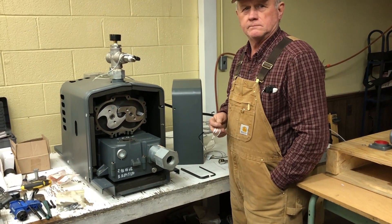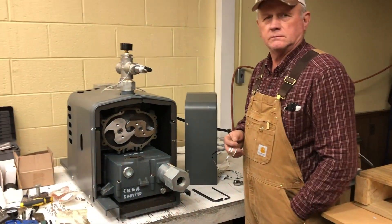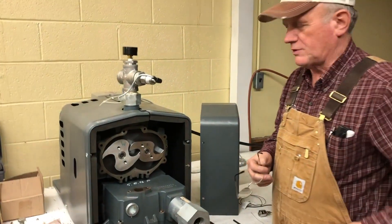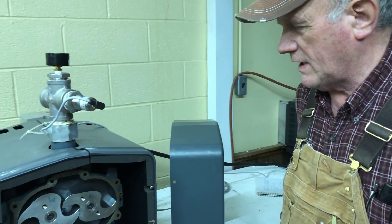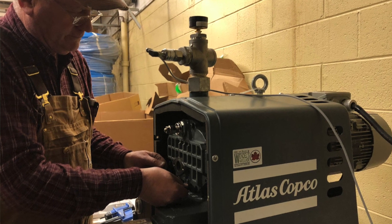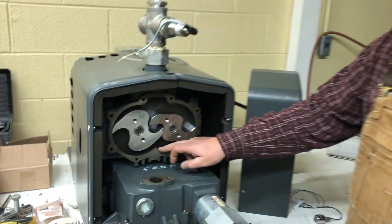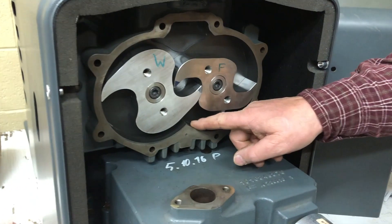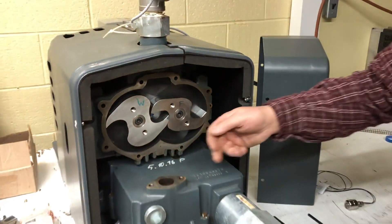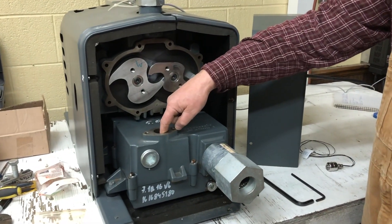There are a lot of advantages to these pumps, so Fred is going to tell us about them. We're in the back room, kind of the shop area, getting them ready for the season coming up. This is an Atlas Copco DZS 065. It's 48 CFM. It's a dry claw pump, and the technology is that these are stainless steel claws. There's about half a thousandth of an inch clearance in here. As they go around, we're sucking in here and blowing out — I took this apart, blew out the housing and down through a noise reducer, and this is the exhaust.